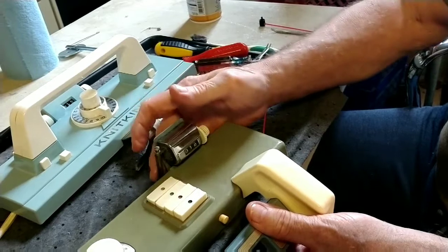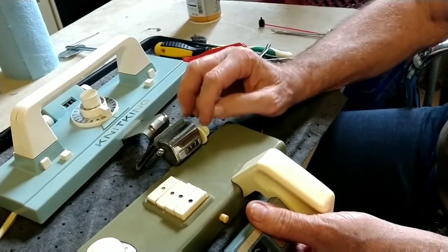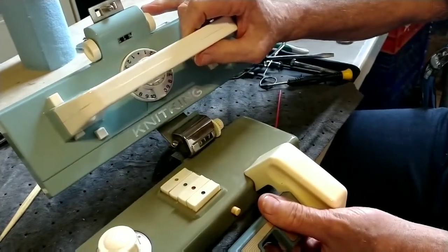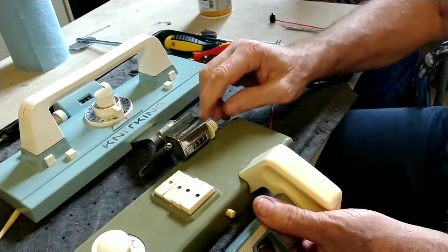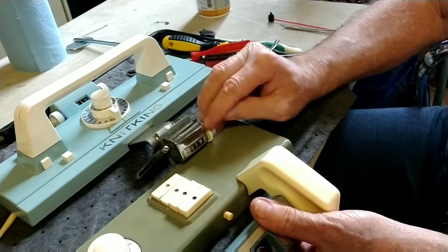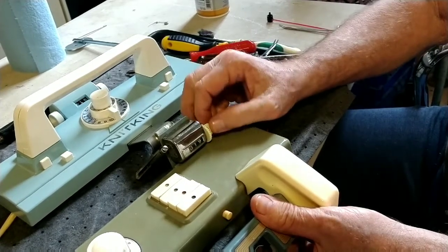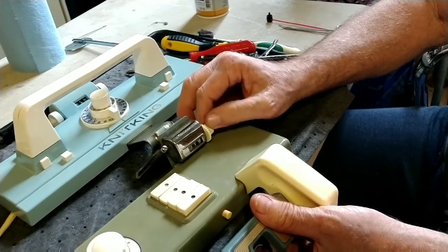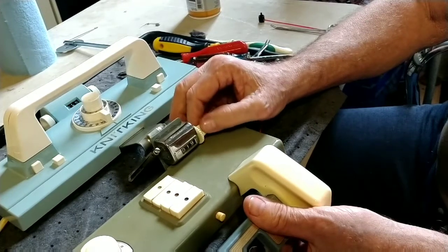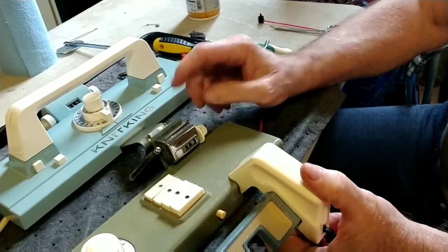So the near wheel to the housing, the big one, is the singles. And the little wheel, okay? On this machine, we had two different wheels. Left and right. This one, inside, outside. The inside wheel is our ones, and it'll go in either direction. The outside wheel is our zeroing, but look, it's not doing a thing in one direction. This confused me no end when I first got it, and I couldn't figure out how to zero the darn thing without knitting it to 1,000.